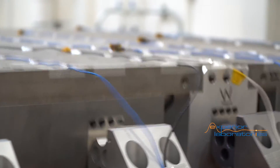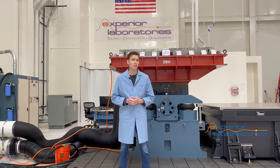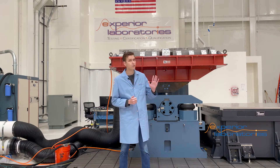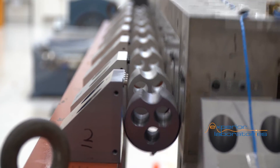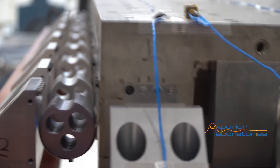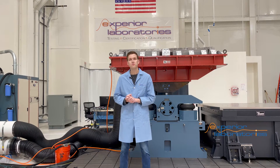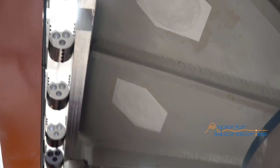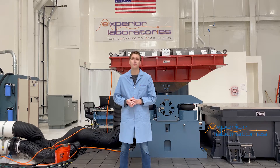These bearings have several advantageous features. First, they restrain motion vertically while allowing for moderate lateral displacement for thermal expansion. Second, they provide maximum lateral stiffness when lateral displacement nears the shaker's internal limits. Third, they provide minimal vertical stiffness to avoid interference with the airbags' isolating functionality. And fourth, these elements are made out of fatigue-resistant 2024 aluminum for long life.